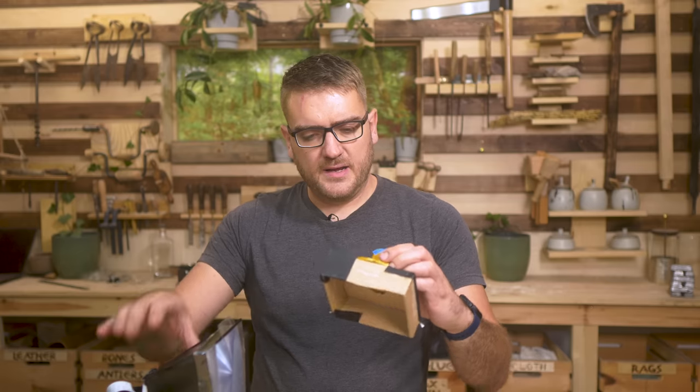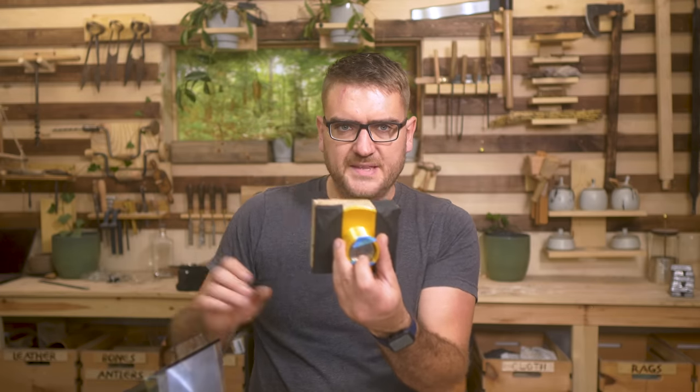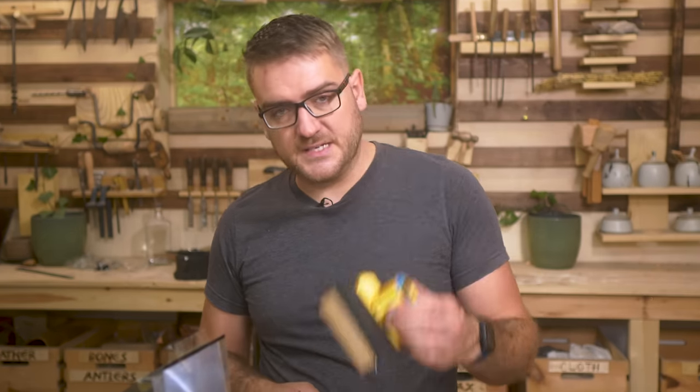We have the sensor rigged up with the ground glass, and then we have our lenses here with a temporary testing mount — basically a little rudimentary camera now for testing. I'm only using the inner two lenses, which is kind of the nice thing about this lens: of the three elements, you can actually ditch the third one and still use it. Testing these first two lenses with our new setup, I feel like we've already gotten a pretty clear image. I tested with and without the Fresnel lens — it's not a huge difference, but it definitely brightens it up a little on the edges. We have some very heavy vignetting. Everything looks pretty clear so far — just a few scratches and smudges that can be cleaned off pretty easily.